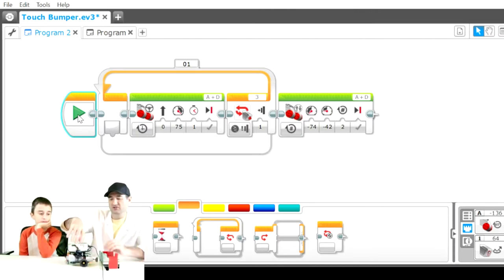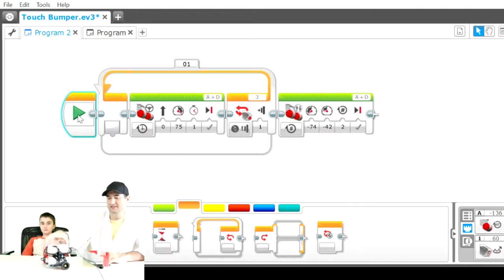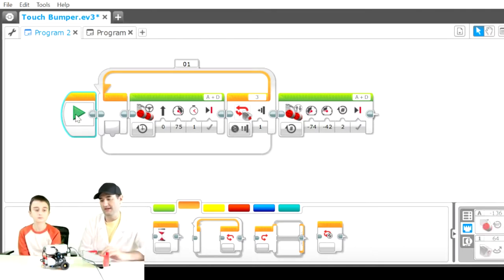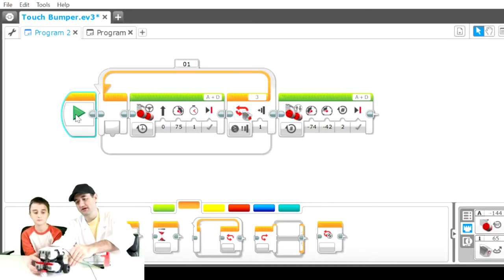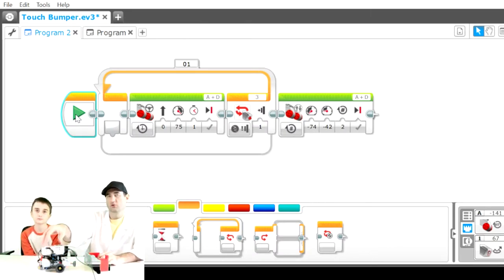That's okay if it's really short like this. If it runs in, it's gonna run flat into the wall. So be cognizant of that and understand that when it runs into the wall like this, and I'll show you it running into the wall like that, that's better than if you had this big plunger out front. If you had this big plunger out front, it's going to turn your robot until it's flat against the wall, until it runs out of steam, and then goes and turns backwards. So just be aware of that when you're running into a wall and using the wall as guidance as to where the robot needs to go.